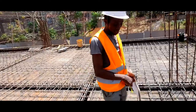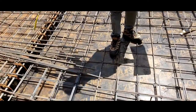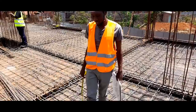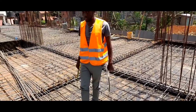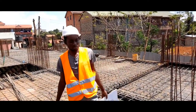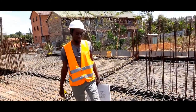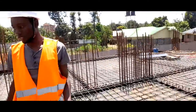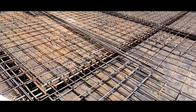From observation we realize that in the middle section we only have reinforcement on the lower layers, and close to the edges you have reinforcement as a double mesh. This is normally because we have hogging moments close to your supports but not in the middle — what we have there is deflection and the bottom steel bars are able to take care of that. Our slabs are two-way spanning slabs, supported by beams on all four edges.